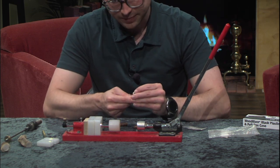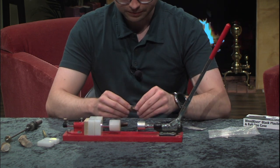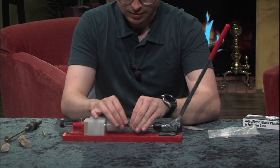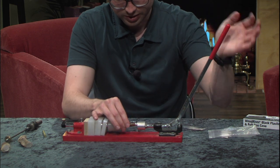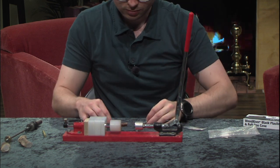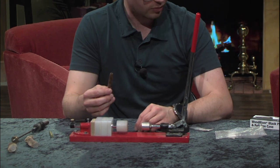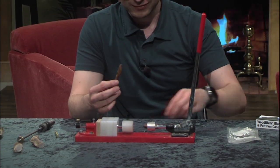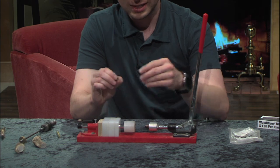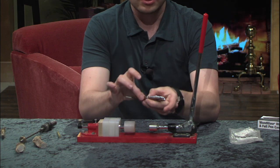So now we're going to put the cap top on top of this rifle clip and press it together. Don't forget to add the block on the end that gives you the proper distance for pressing your parts together. Once you have the nib, you just slide the ink refill in, which it appears I don't have included in this kit. But normally, you would put the ink refill in, and then you're going to snap the center band on, and you press these parts together, and you would have your finished pen.